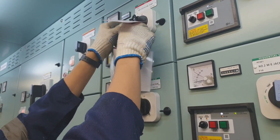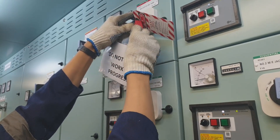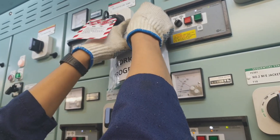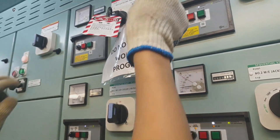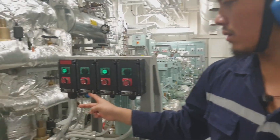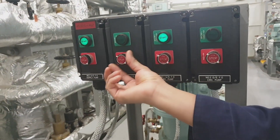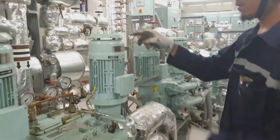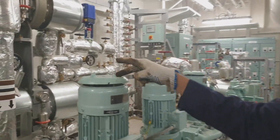As always guys, we need to conduct a lockout and tagout of the machinery and keep the key of the lock until the completion of the job. We will clean the number two diesel generator fuel oil circulating pump and we should lock from the local side for additional safety.